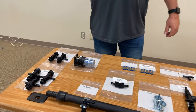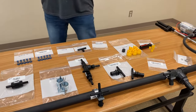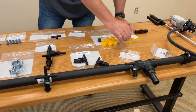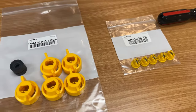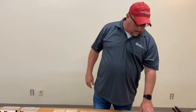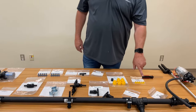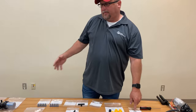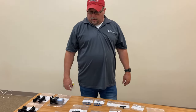On your nozzle selection, that's usually custom as well, depending on how many gallons per acre or per square foot you're doing. Typically I use the yellow nozzles when I set one up — that's like a slow-moving 3 to 4 mile-an-hour nozzle. It's an XR 110-02, so you can be 20 inches off the ground. We're going to have another video soon about the different nozzles. But for now I'm just going to recommend the yellow — an XR 110-02, which is a 0.2 gallon per minute, about 10 to 15 gallon-per-acre nozzle if you're running 3 to 5 miles an hour, which is generally what you're doing spraying in your yard or doing 2-4-D or Roundup.